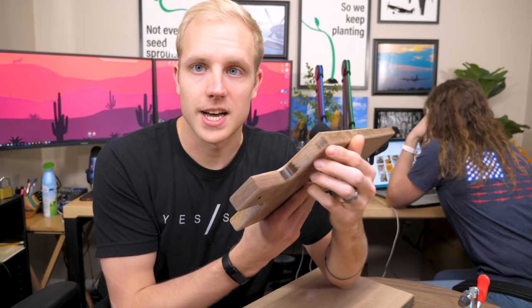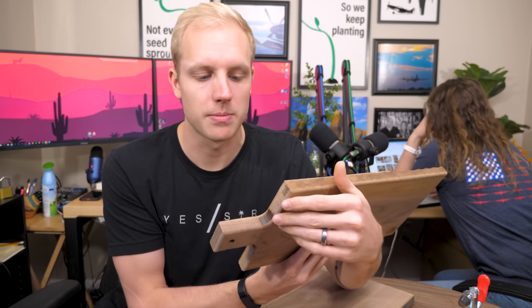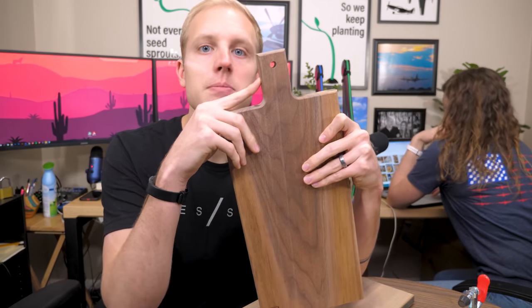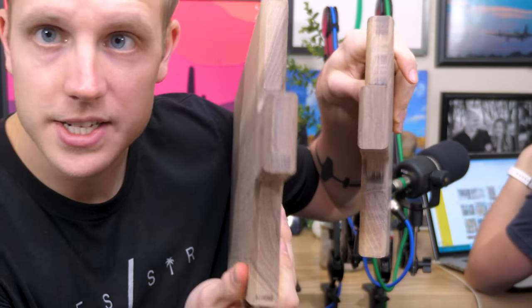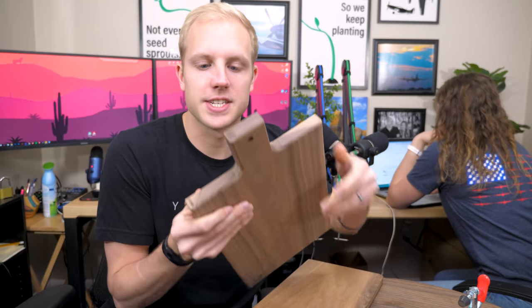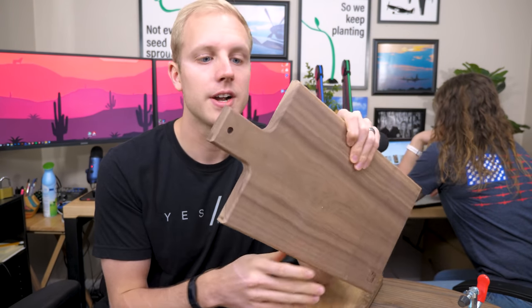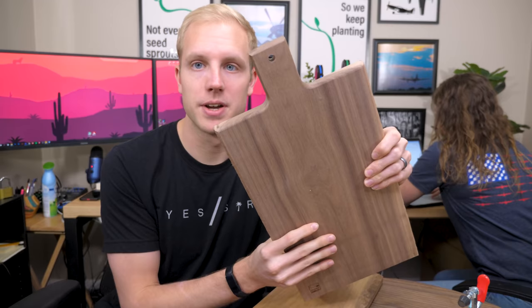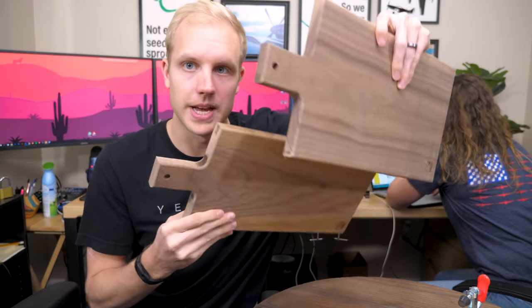We wanted to show you some before and after of the boards with the old jig and with the new jig. We left off last time with a bunch of burn marks in the corners — these are pretty deep and took a lot of hand sanding to get rid of, so obviously we can't have that as part of our process. Also the handle is kind of a bump on one side. After the improvement, there's a pretty considerable difference — way less burning. Making the radius a little bit bigger than the router bit's radius really helped with the burning, and slowing the router down quite a bit also helped. It looks way better and cleaner — the handle is perfectly straight and parallel.